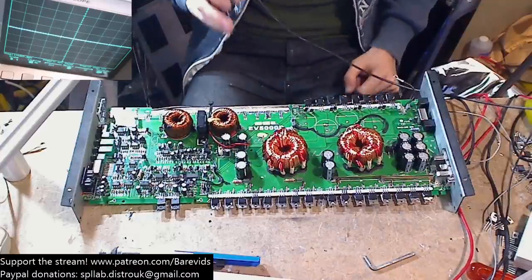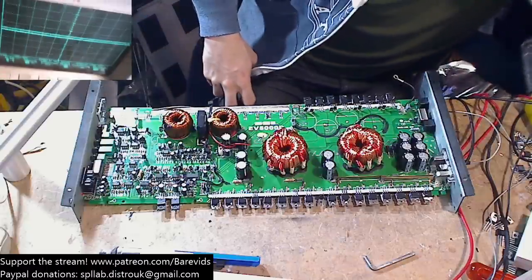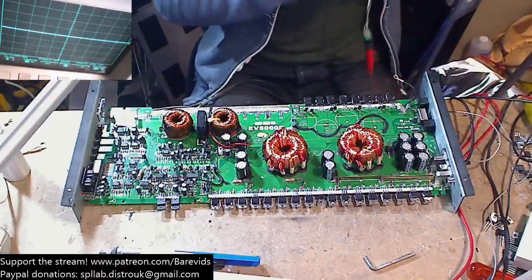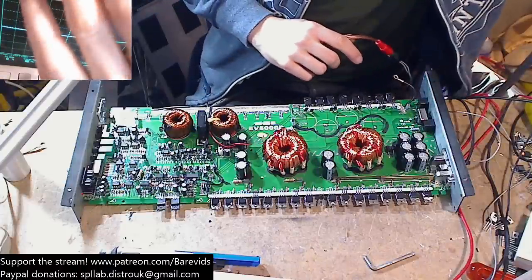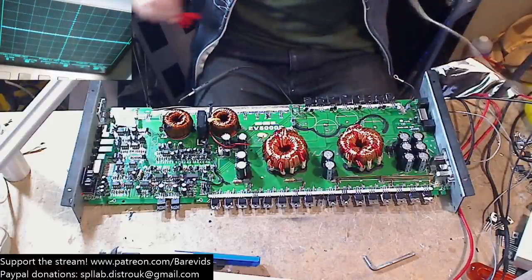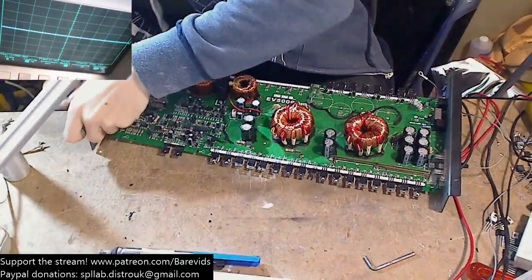So I think this amplifier, we're gonna need to feed it with some RCA signal. So I'm gonna turn on my frequency generator, and we're gonna chuck a 50 hertz through her. And I'm going to start off on relatively low amplitude. So let's plug this into the inputs.